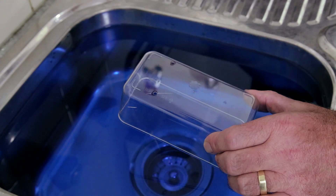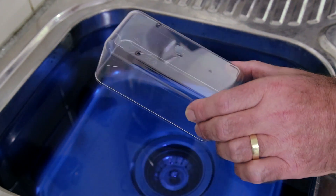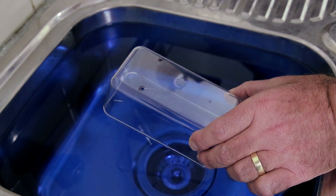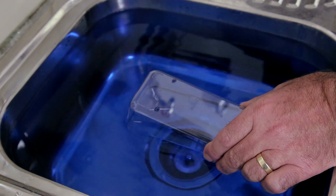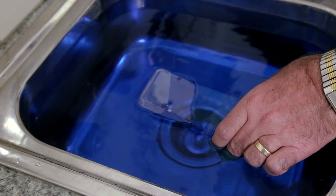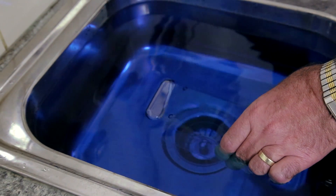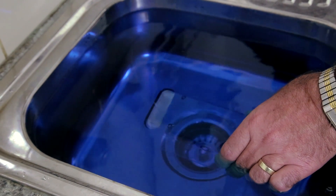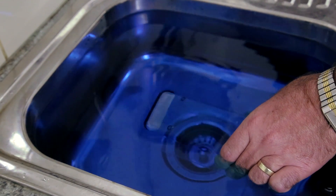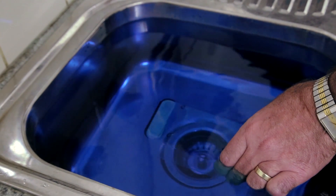This piece of plastic resembles the pocket in the channel we explained previously. We're going to simulate this going into the zinc — going in slowly — and we have holes in there. You can see the air is coming out, up to a point, and now there's an air bubble in the top corner. Where the water doesn't wet the plastic simulates exactly where the zinc doesn't get into contact with the steel. If the zinc is not in touch with the steel, the galvanizing process cannot take place, and we have a defect called a miss.